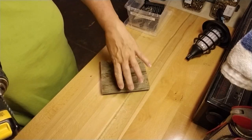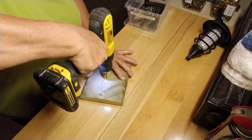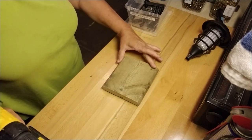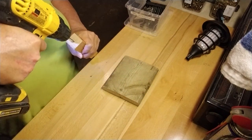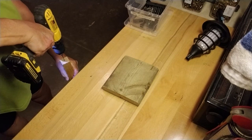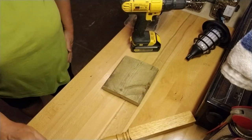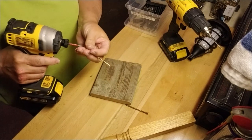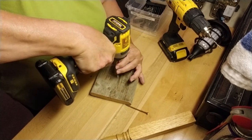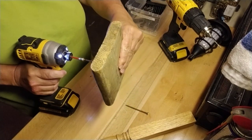I'm creating a base for each of the spindles — I'm going to do two of them. I'm pre-drilling a hole for my deck screw because I don't want this wood to split. It was an old deck board and it's really dry, so I wanted to make sure I don't crack it by accident. I'm also drilling a pilot hole into the spindle. Spindles are really hard wood, and you definitely can't get a screw in there without doing a pilot hole first.